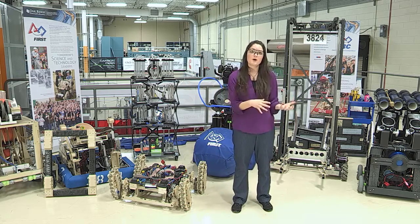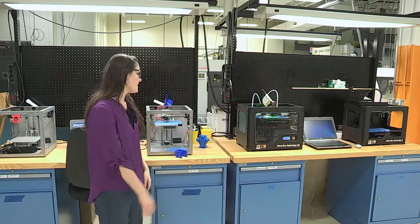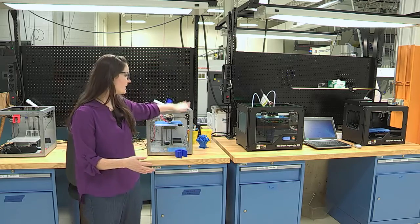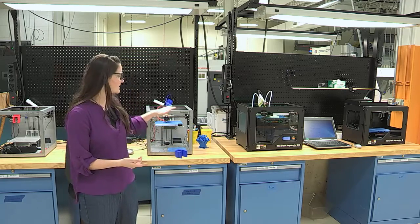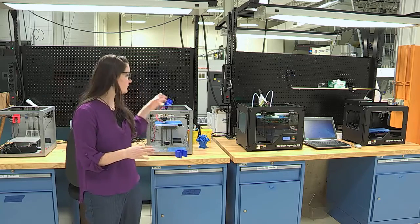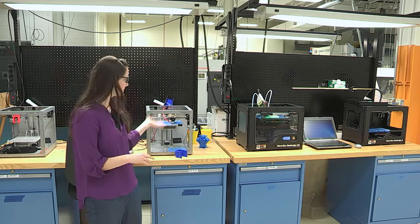Now we're going to go talk about some small scale or desktop 3D printers. These are our desktop or consumer based 3D printers — the less expensive versions. I actually have one of these at home; it's the Solid Doodle 3rd Gen, about $800. These are really awesome for research because they are so inexpensive and they're pretty analogous to the larger scale FDM systems. In fact, the carbon filled ABS that we use on the BAM system was actually originally printed on one of these desktop systems. We found that with the desktop system, we had a lot more control and accuracy with a carbon filled ABS than we did with the normal ABS.